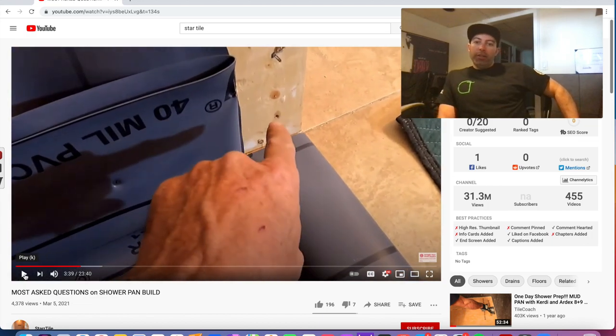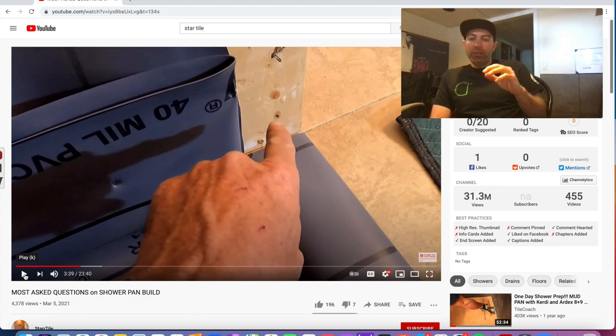All right. He's making the statement that it's okay not to put the corner piece there. And I can see his point because he's using liquid membrane. He likes to use RedGard a lot to waterproof the whole shebang. But again, we can look this up in the book, TCNA. He's got a system he's using here that's called a water in, water out, traditional pan liner type system here. And he doesn't even use a pre-slope as far as I know.